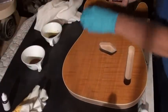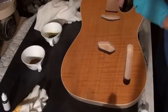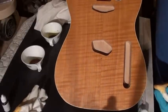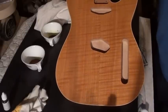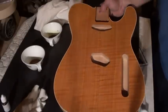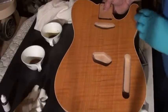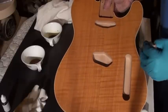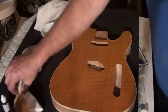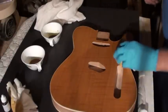This is going to be getting the burst, so it will give the effect of looking brighter in the center just because of the dark burst going around it. Once that True Oil goes on, I tell you it's just a night and day difference. It's looking good already and it would be fine in most cases, but I wanted to take it to the next level. I'm going to let that dry - it'll dry lighter so it won't look like it does now wet. We'll go back and review and see if there's any more I want to do with that.